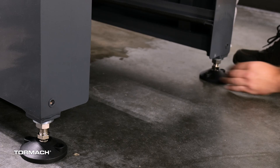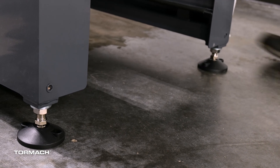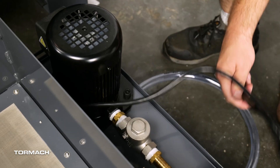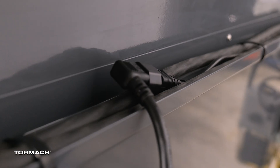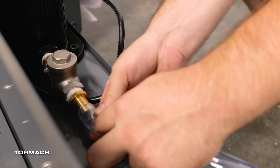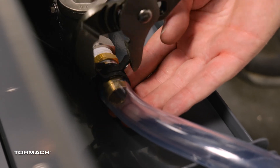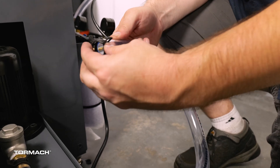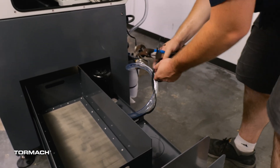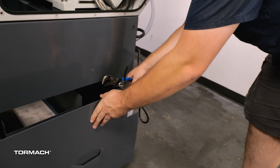The stand on the 15LX is very sturdy and nothing more than basic leveling is needed. Roll the coolant tank under the lathe and connect the pump's power cord to the cord on the rear tray. Find the tube clamps and slide them onto either end of the pump tube. Wiggle the tube onto the brass fitting and use channel lock pliers to secure each clamp into place. Pick up the cord and the tube then roll the tank under the lathe, dripping both through the cutout.